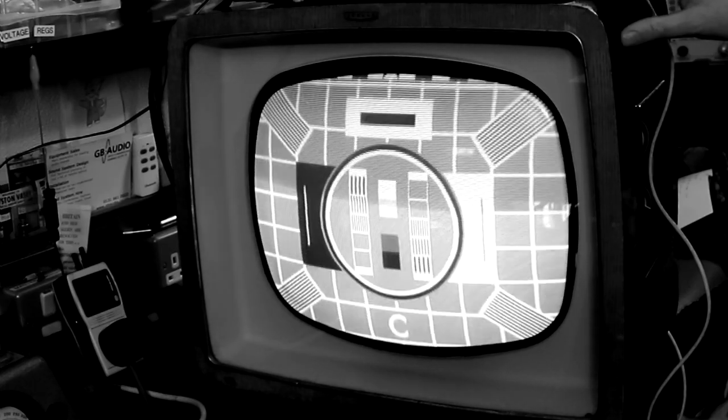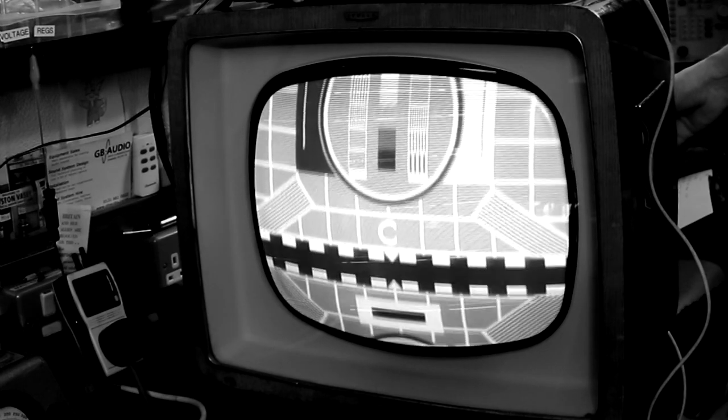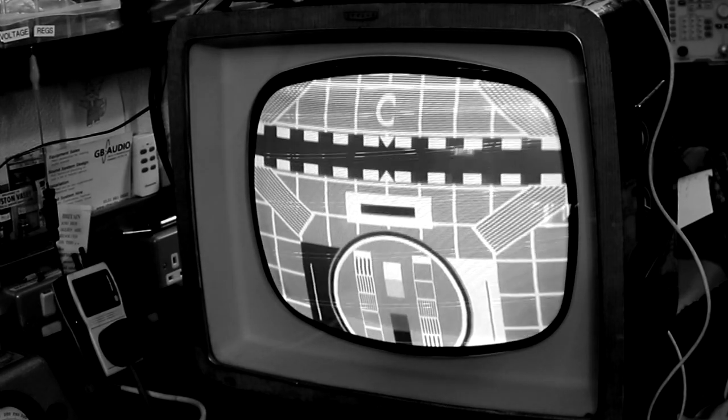Okay, well, I've just been up on the roof of the house and I've adjusted my television antenna to point towards 1960. And as you can see, we're actually getting a test card now, which is quite good. But of course, we still have this problem with the actual vertical hold. It's still rolling. Although I can try to slow it down. I can adjust it. I just can't quite get it to lock, he said. Almost locking there, isn't it? But not quite.